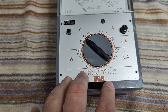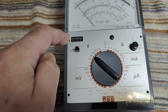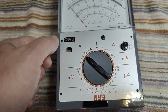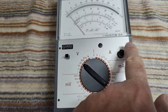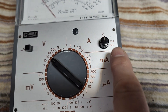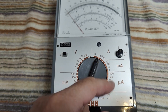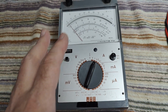To do capacitance you need an external AC source, which is quite normal. This is the current overload reset — there's a mechanical relay and current goes through this relay and it releases the current. This is a little bit special. This is the on-off switch for everything: voltage, amps, resistance, and capacitance. Everything goes with this on-off switch, not only the dial for main feature. This is what is interesting about this meter.